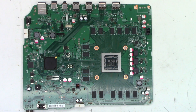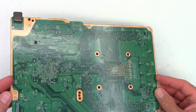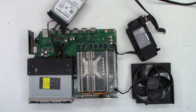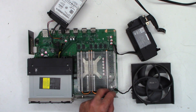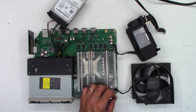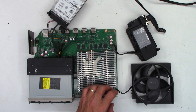I thought I'd try one last thing. I went ahead and popped off the heat sink, cleaned off all the thermal compound, and I popped this whole board into my dishwasher to run a full cycle on it to clean any contaminants that might be on the board. Let's see if it made any kind of difference. Power on — the fan still bumps, just as before. Power switch — no difference. Actually stayed on for about three seconds that time, then it shut off on its own. You even heard the on tone and the off tone. That time very short.